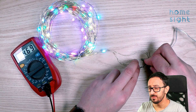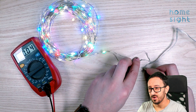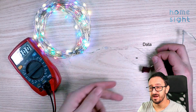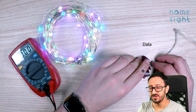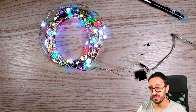Between those two I'm getting 3.8, so I'm guessing one of those is the data pin. Those bottom two I'm fairly certain - they're getting 4.69 to 4.7 depending on how well I make the connection. I'm pretty certain that's my positive and my negative, and that top wire is the data feed. It might be different for yours, of course, so I'm going to get a bit of tape and write on each wire to label them.